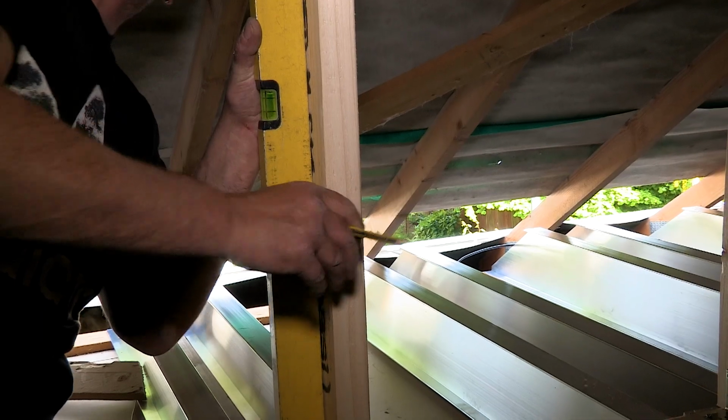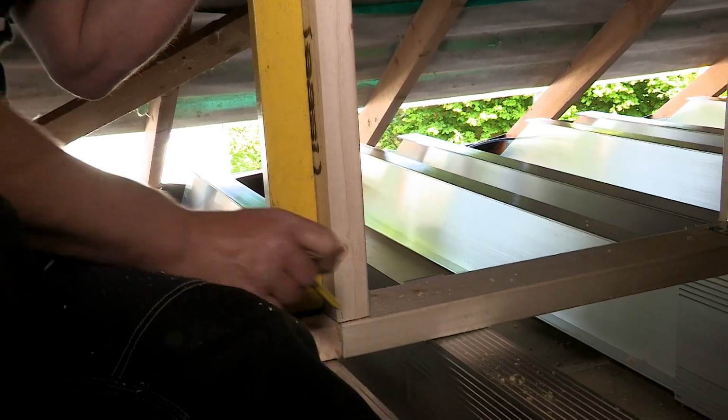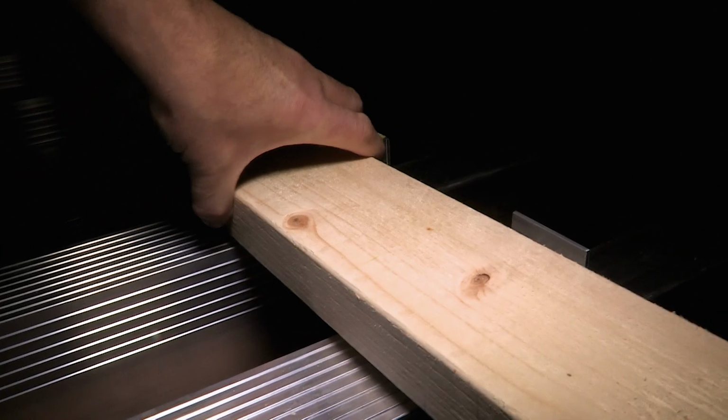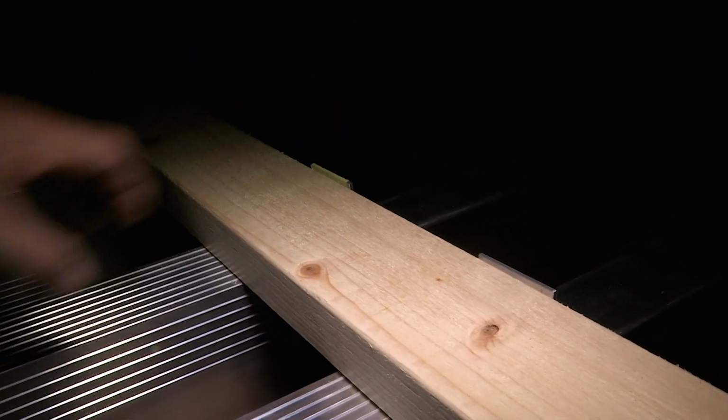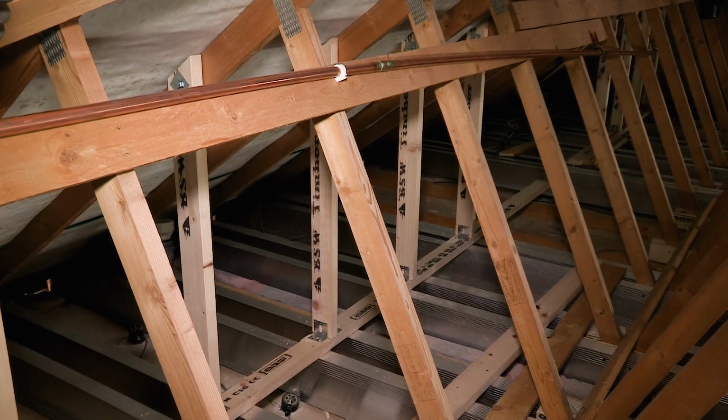Roof support stud work is formed with a horizontal sole plate and 1 stud per truss. The sole plate is fixed to the telebeams through the back of the angle plates, and studs then bolted to the rafter section of each truss.